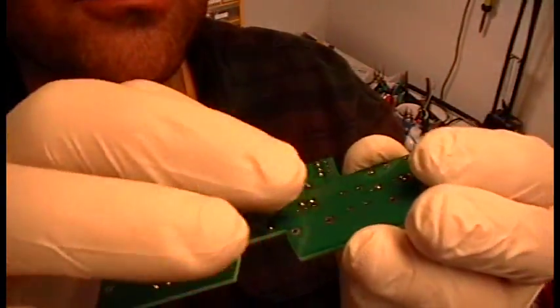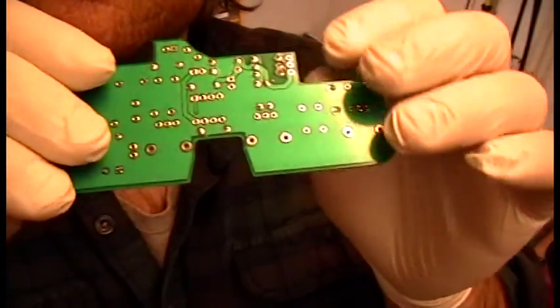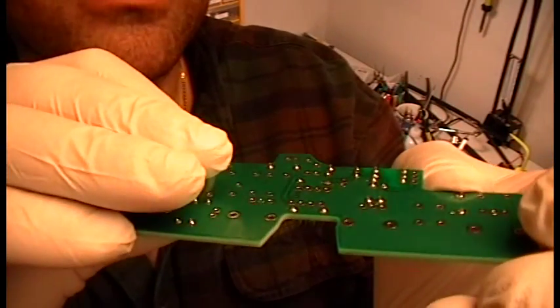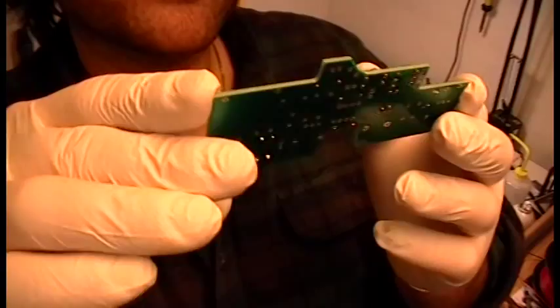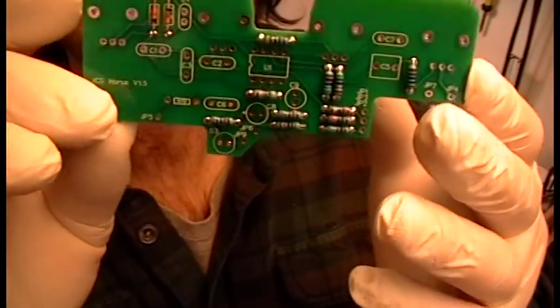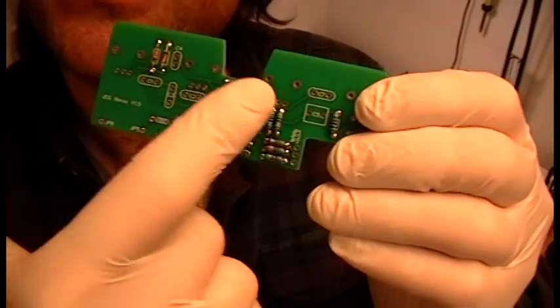All the flux, there's no liquid. It's not burnt. It looks kind of glossy amber. All of the joints look nice and neat. There's no big globs. Everything is actually soldered. There's no voids. Just a general inspection, and then we'll turn it over. And see, that's nice. We're going to check that we actually had all of the solder flow through to the top.